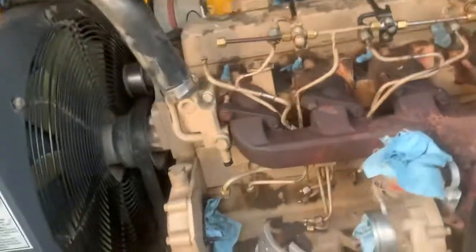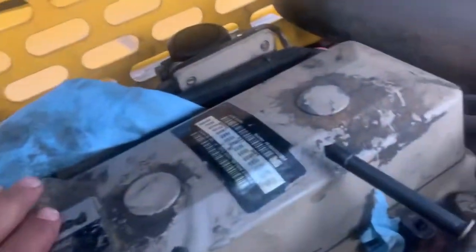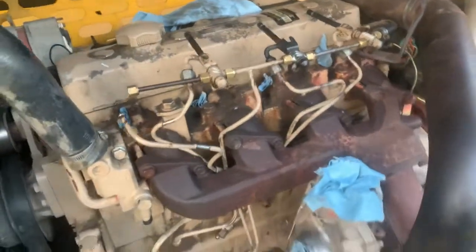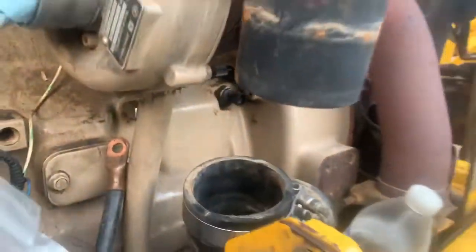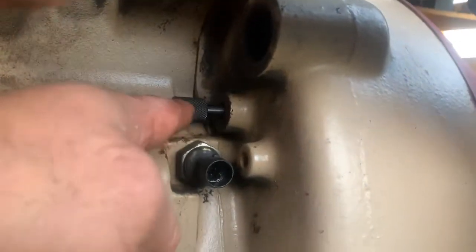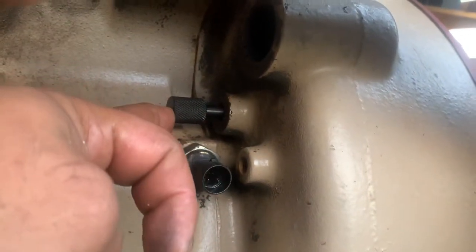So that's the engine — it's a John Deere engine. This is where the lock pin is located. The engine needs to be timed before you take off the pump.